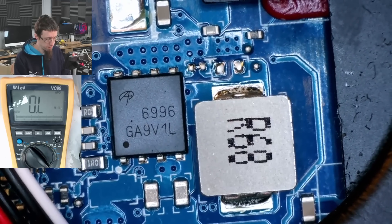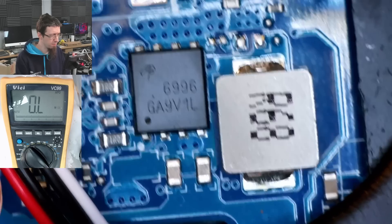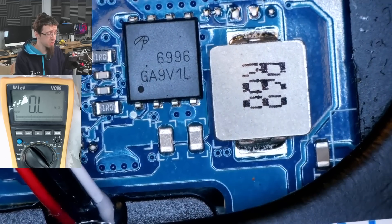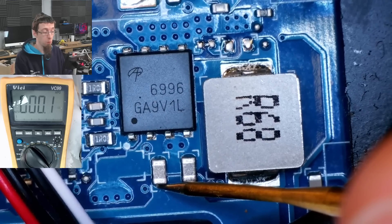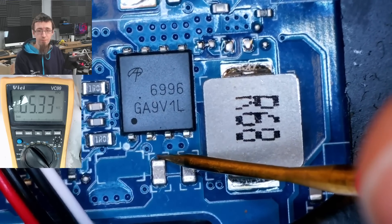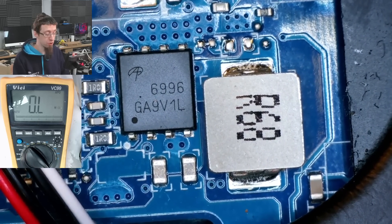Let's wander down here nearer to the GPU. We've got a GPU down here — there's another big power rail. We can check the input for this and see if that's shorted. Black probe onto a screw hole — these capacitors have one side as ground and the other side as power. The ground side has no resistance to ground, confirming it. The other side: 0.3 ohms again — same short circuit. So it looks like our main power rail is shorted to ground.